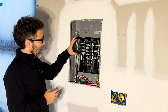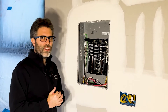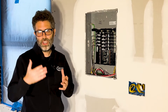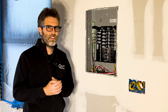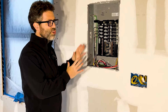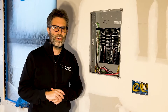The second key element is the kind of circuit breakers we're using. Wherever appropriate, we are using both AFCI and GFCI circuit breakers. AFCI basically means that if something happens inside the walls and causes arcing, it's going to shut that off before you end up with a fire situation. GFCI is designed to protect you — if you plug something in and there's water involved, or the appliance is old and something's going on, it's going to protect the person from electrical danger. We use AFCI and GFCI circuit breakers throughout and wire everything like this is a house being built to the best quality standards in 2023.